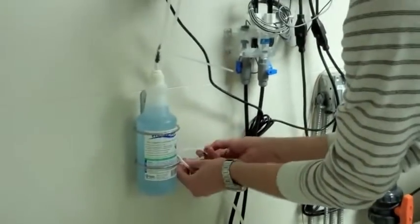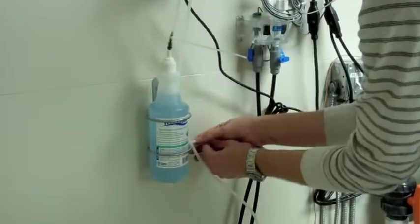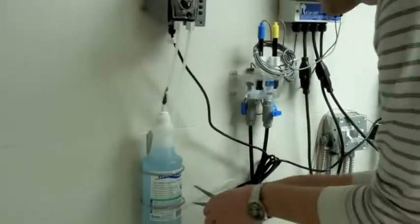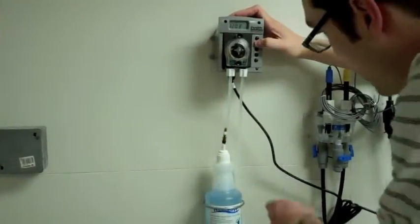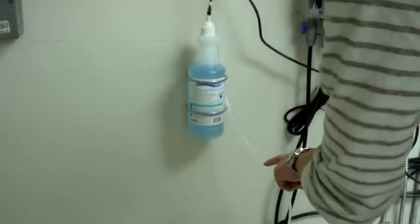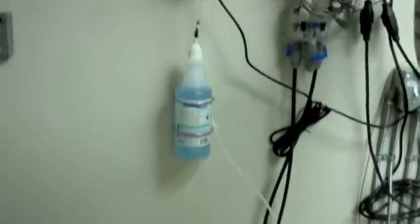Once your lines are nicely cleaned up, you can plug in the metering system and then prime it to check the lines and check for any air entering the system. To do this, simply press the prime button and hold it down, watching as the heat saver liquid fills the lines, looking for any leaks at the fittings. If you find any air leaks, re-tighten the fittings.